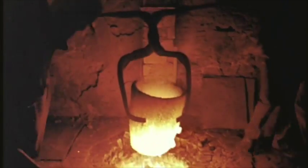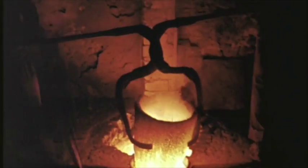Here at the art foundry, we cannot arrange our equipment as in a commercial foundry, because we must handle the metal as we want. We take the metal from the oven and we have no pyrometer to judge the temperature. It is our experience which judges the right temperature, because I must consider how hot the metal must be, more or less in proportion to the figure which I must cast.